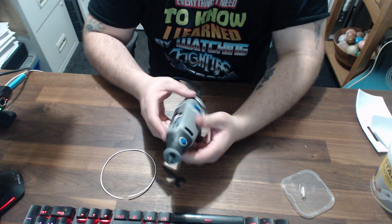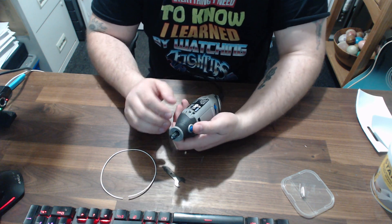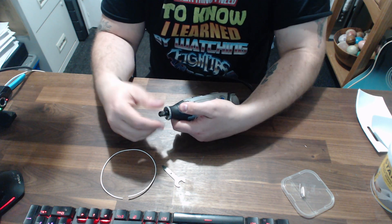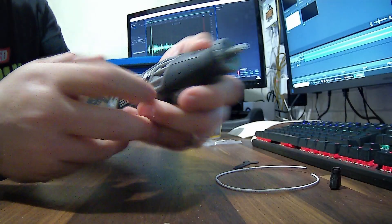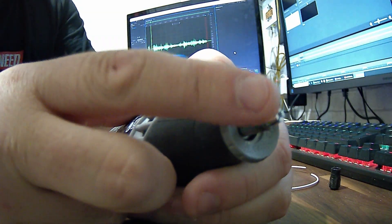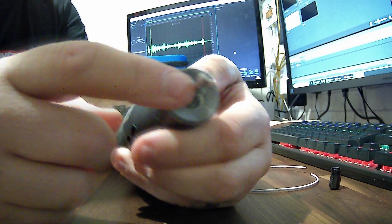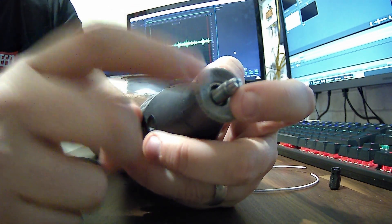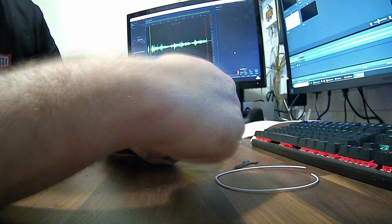What you're going to need is a Dremel. The Dremels come with standard collets which actually don't fit PLA, so you're going to have to buy a different collet — you can bodge it to work and I'll show you that later. We're going to change out the collet to a different one that fits the 1.75 millimeter filament. They just pop in and out really easily. I picked up a pack from B&Q which had a 1.75 millimeter collet in it.